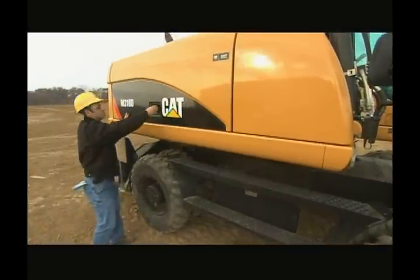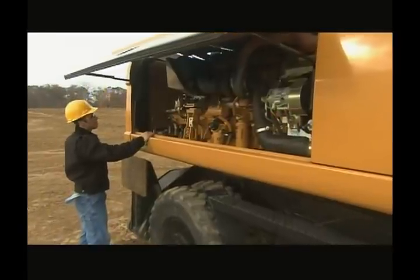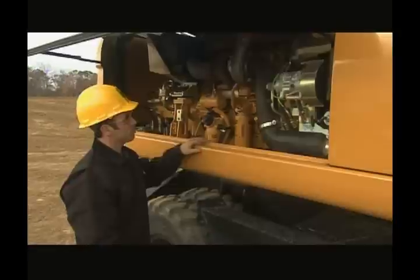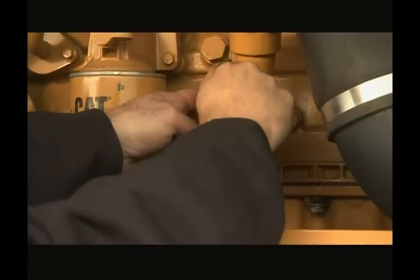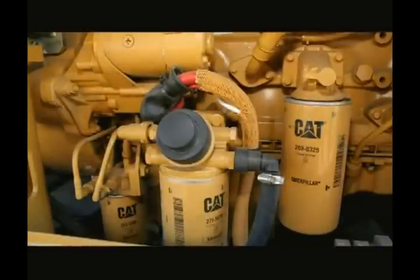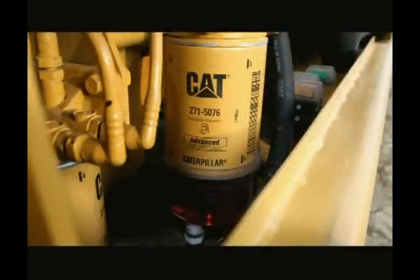Also on the right rear corner, you'll notice gull wing doors with pneumatically assisted lift cylinders that effortlessly lift up for exceptional access to the engine and all service points. Inside this compartment, you can check the engine, the engine oil, and the hydraulic oil. This is also where you'll find the hydraulic oil level sight glass, the engine oil dipstick, and fill if required. Visually inspect the compartment for leaks, accumulation of debris, and worn belts. This compartment also houses the oil filters, fuel filters, as well as the fuel and water separator.